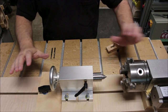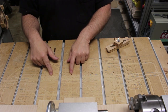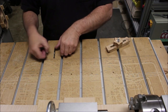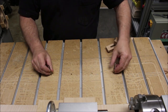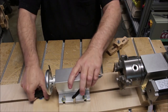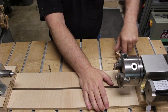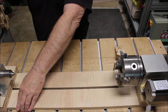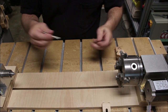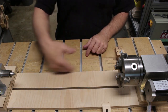To set this on the table, you can see I've got four kind of blind holes right here — I just put a quarter-inch end mill in my spindle and put them in maybe a quarter inch deep. Basically I take old router bits, put them in those holes, set the rotary axis and pull it against them, then tighten it down with clamps in three or four places and I'm good to go. Once my clamps are fastened, I pull the router bits out and keep them in a T-track on the far side. That's what I use to get everything parallel with the X-axis.